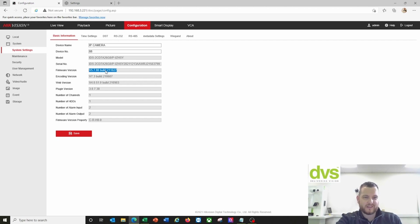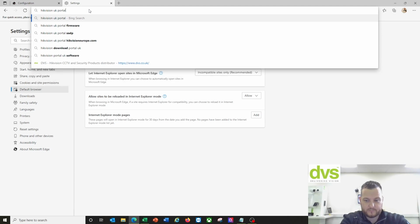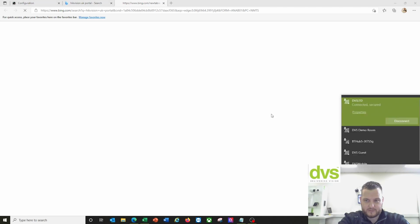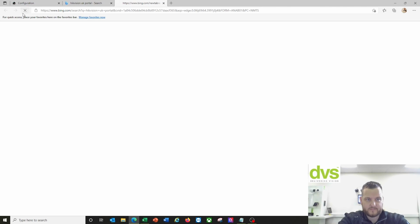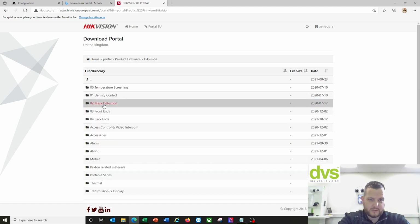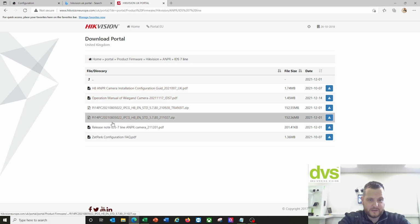That's the current firmware, which is currently the latest, but I would always recommend that you are on the latest firmware. And to do that, if I just go to here and go Hikvision UK portal, there's an EU and a UK one. Come on, wait for this to load. So Portal UK. Portal, product firmware, Hikvision, ANPR has its own subsection. It's the IDS 7 line, but all of the other versions are there. And you can see here, that's the latest firmware.